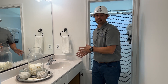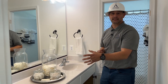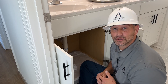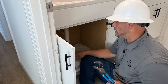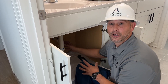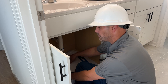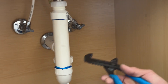We're going to move over to the first sink here on the left to demonstrate how the trap comes apart and then gets put back together leak free. Tools you will need are a pair of channel locks and a couple of rags. Right before you get ready to take apart the trap, you're going to get some water left in the bottom of the trap, so I have placed a trash bag or towel so we don't mess up the cabinet base.